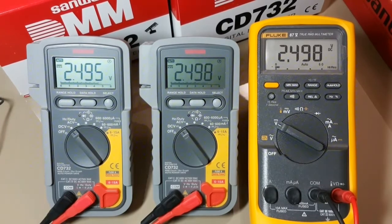Now we're going up one more notch to 5.000 volts. There's a little bit of flutter on the Fluke, but it's back to 5.000 — spot on. The Sanwa is showing 5.002, and the other Sanwa is showing 4.995 — that's about five counts off. Still well within spec.